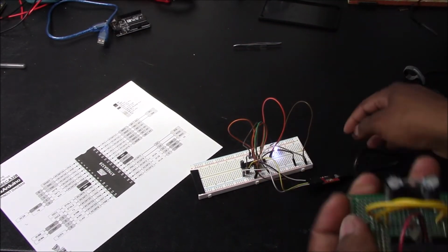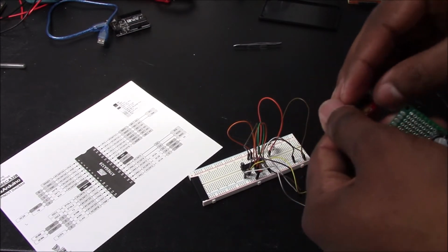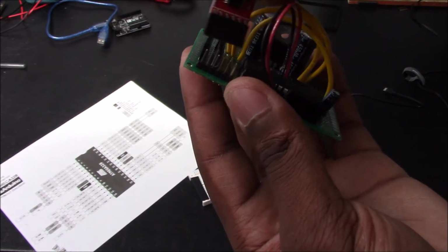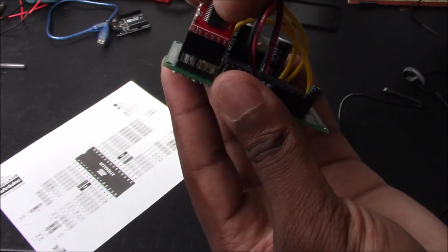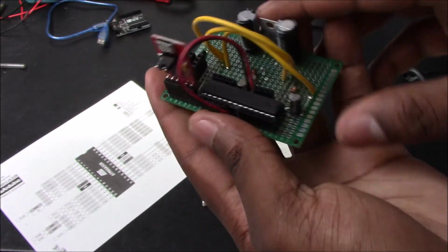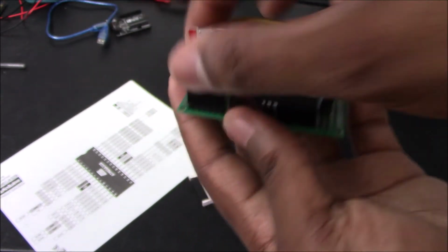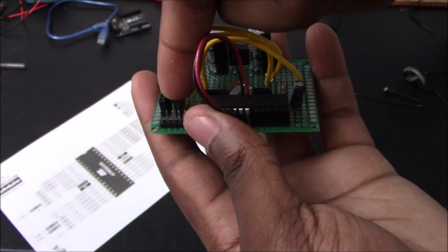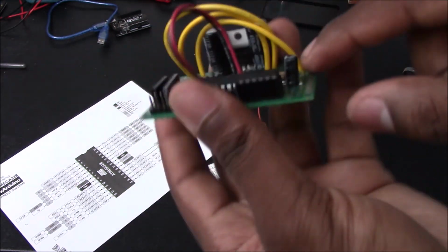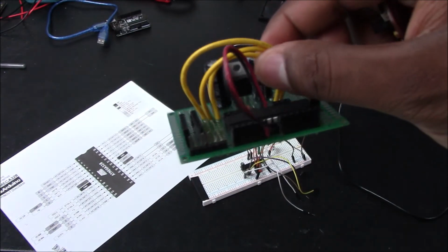I actually rigged it up so that, once I have this disconnected, if I wanted to reprogram this, all I would have to do is line it up correctly so that this is ground here, connect it, and you can just sit it on there. Once you sit it on, you connect the micro USB to your computer, and then you just upload whatever you need to. And it would already be powered from here. And once you remove this, you would have 2 different headers that you could put your positive and negative into. Now, this is grossly inefficient, and this is one of my first designs.